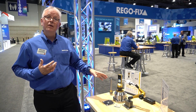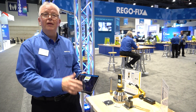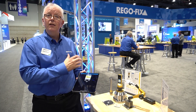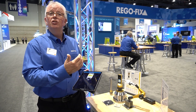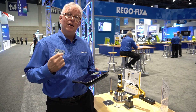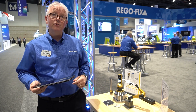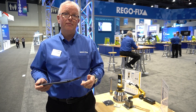Not only can I see the measurement here, but I also have the application available, allowing me to record the data, add it to different machines, and track measurement to measurement — so I can see what happens to my machine spindle over time, allowing me to know when that spindle needs to be repaired or modified.